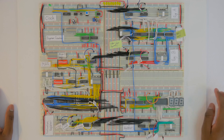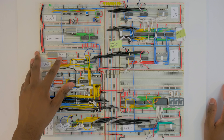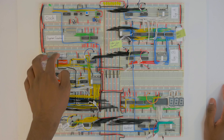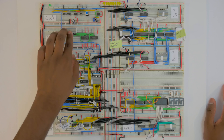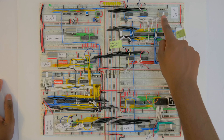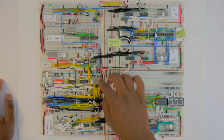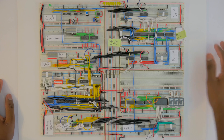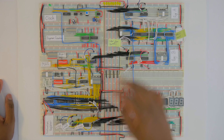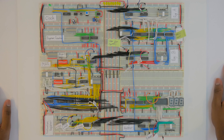You'll notice I have white stuff on all these LED displays. The LED displays varied — some of them I don't need all eight segments. For the program counter I only need four, plus a fifth one that indicates program stage versus run stage, and same for the MAR. For the ones where I need eight I use the full display. I tested all the components to find which LED positions were actually being used, then used white-out on the ones that aren't being used — so the middle ones are whited out on all the registers, and the front ones are whited out on some others.